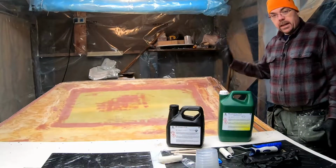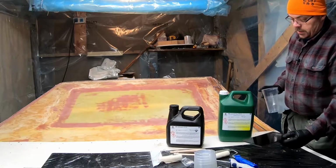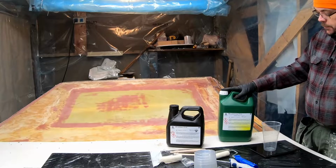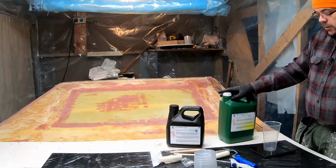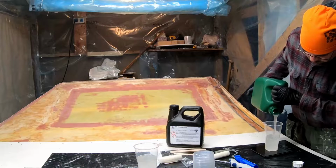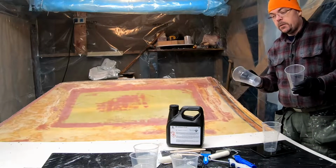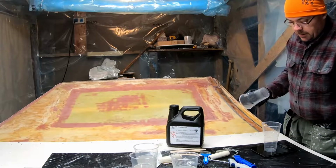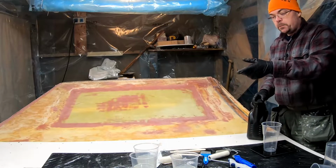Okay, I wiped off that surface now with acetone. Now I can start mixing the epoxy. I'm gonna do batches of about 550 grams. I did some calculations and I'm gonna mix 350 grams of the resin and then 192.7, yeah, 193 grams of hardener. Since I'm going to mix in three batches and I'm going to mix them in two containers, first mix in one and then mix in the second one, I can actually pour up the hardener, 192.7 in each, and then I can pour them over and then pour them back and mix.